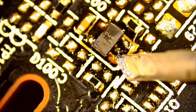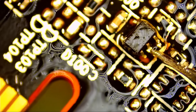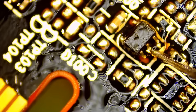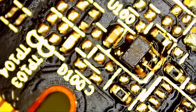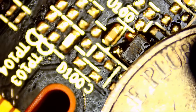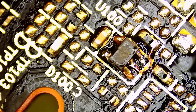The wire is done, and that wire is making a connection. It does not have to be on top of the pin or under the pin — as long as the wire is making a connection. Very nice. That chip is tiny. Look, I have a nickel right next to me — just look at the size of the chip. It equals maybe two letters on that coin. If you have a nickel, try to read those two letters — that's the size of the chip. Not the traces — the chip. The traces are even smaller. You are dealing with a 0.1 millimeter wire.